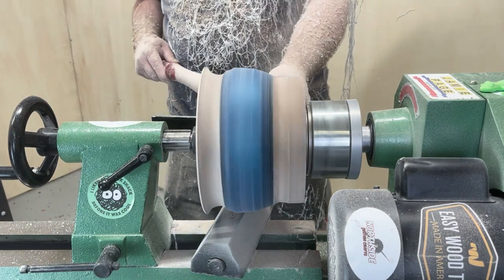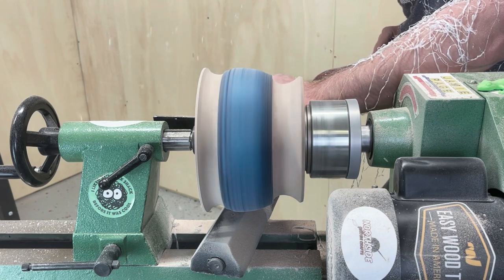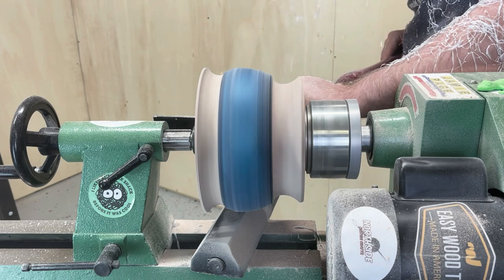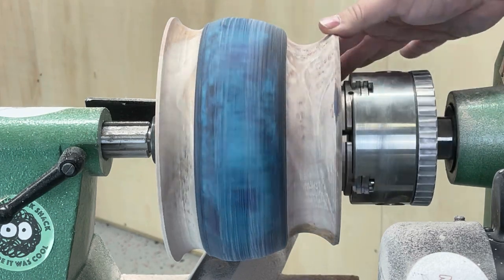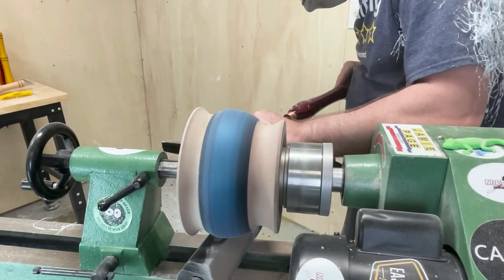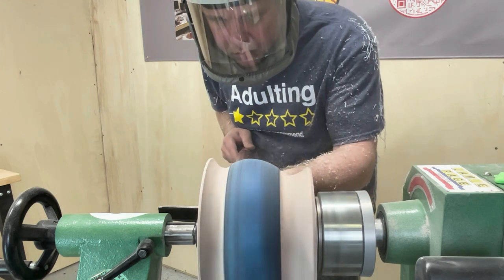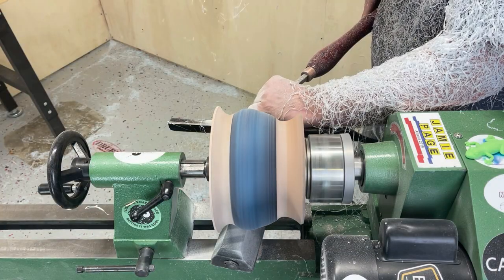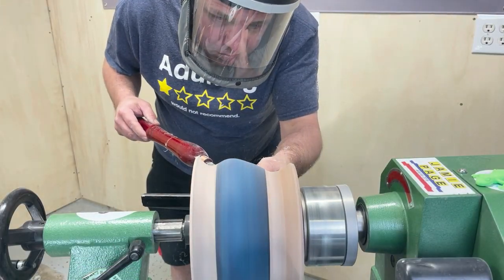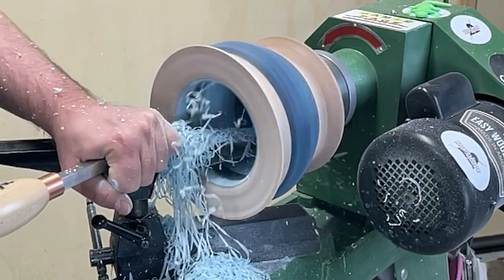At this point I can see where the wood's going to be and where the resin is, and I kind of have a shape in my head, so I just start taking material away until I get to that shape. On this particular project I really don't like the pattern the resin is making right now, but on the sides, top, and bottom of the bowl you can see swirling, and in the middle it's just up and down. The swirling was bugging me, but I'm also worried about the shape of the bowl. So I go ahead and refine the shape how I want it, take a little break, come back, dig a little deeper, keep the same shape — just bring everything down a little bit — and now I'm going to have the swirling I wanted.